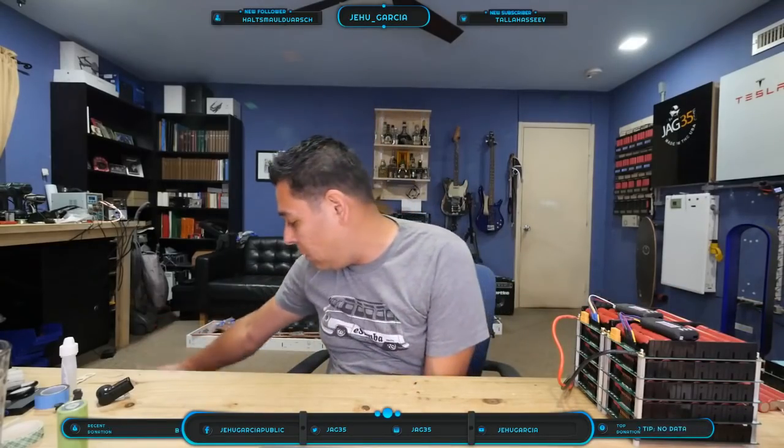I don't have that many boards here, but I think I have enough to do like a 1 or 2 kilowatt pack and then test it. I have a 2.5 kilowatt inverter here that I can load a 2.5 kilowatt pack with, at 1C, because I don't recommend more than 1C. This is strictly for DIY Powerwalls, and then after that, yeah, we'll release it. We'll have all you guys start making your packs, and then see what you guys can do with it.